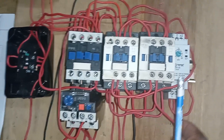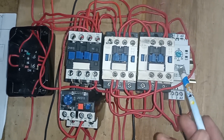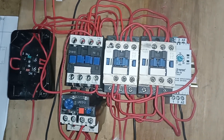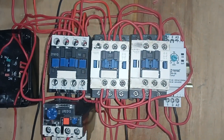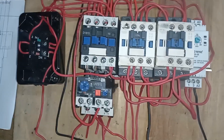With some seconds, when the motor runs to 80% of the speed, the timer switches on, de-energizes the star contactor and energizes the delta contactor, whereby the motor runs to its full speed.